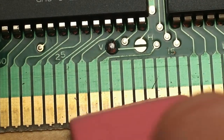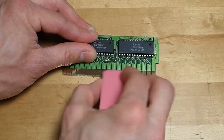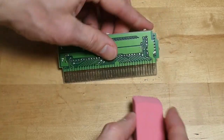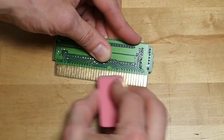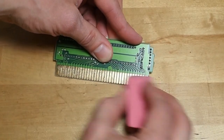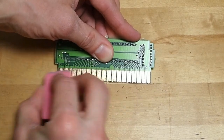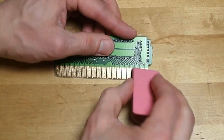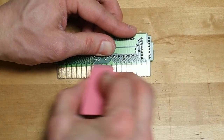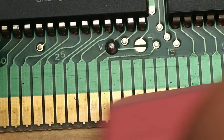All the gunk, hopefully, that has accumulated on the contacts without really doing much damage to the contacts. If it's really bad, you can try some emery cloth or some very fine sandpaper. The problem with that method is you will be eating away on these gold contacts — there's not a lot of metal there, and you could rub off too much, and then you are in trouble.